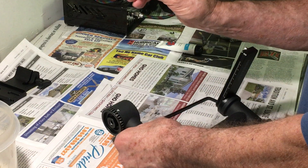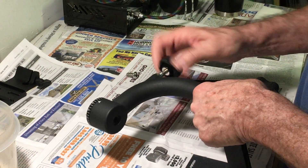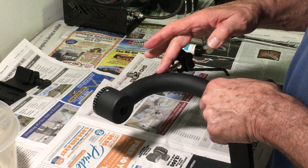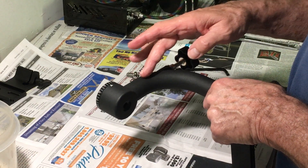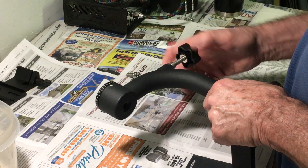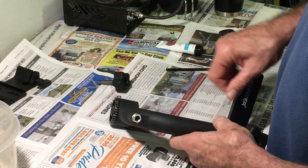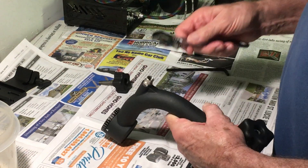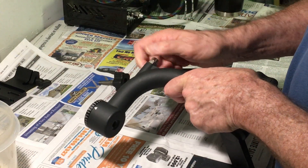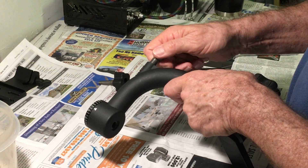The next thing you want to do is take this knob off right here. What this knob does is — there's a long screw at the end of this knob and it threads down into this bracket here. It's hollow and there's a ram inside, so the screw pushes on the ram which pushes on this base, which snugs it up or loosens it — whatever the case may be. So you take this off. Now you've got this sleeve on here. I just use a crescent wrench because that's what I had available. It's not even a quarter of a turn and this thing's already loosened — this is not on tight at all.